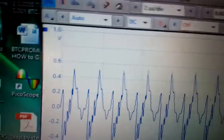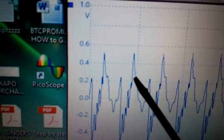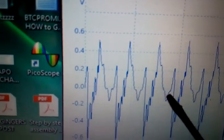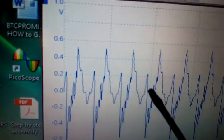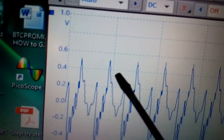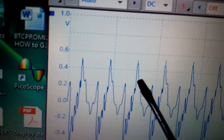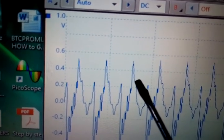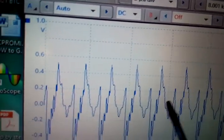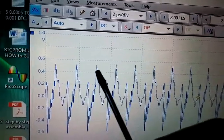These are the signals coming out of the base — you can see these peaks stopping right there. Before the mod it was like a sine wave with very small peaks, but now with this installed it increased the peaks more and managed to get a well-defined dead time at the very tip of the waveform.